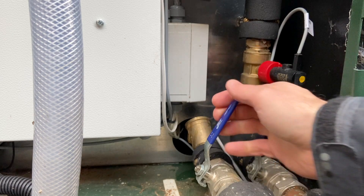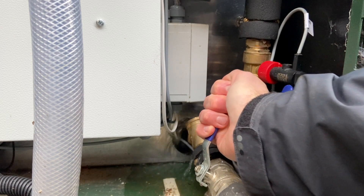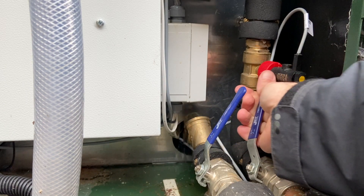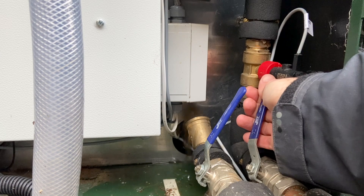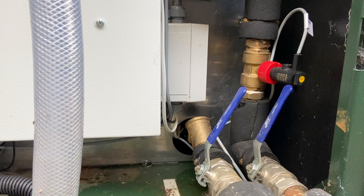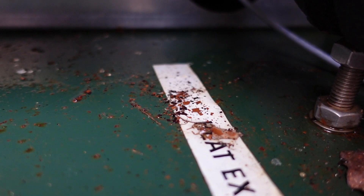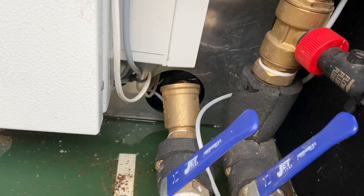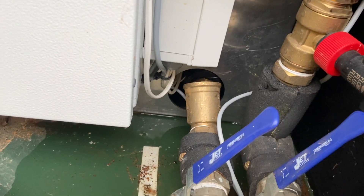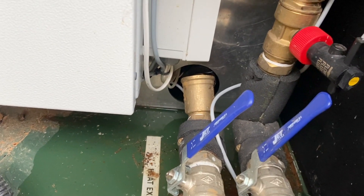What you've got to do is take these taps and just clear it out. One very important point to add here is that only flush out small amounts of water — enough just to push out any debris — and the reason for that is that every time you're flushing out the water you're also flushing out glycol or antifreeze that's in your system. Obviously you don't want to drop those levels too much because that can lead to its own problems, so when you're flushing, small quantities and don't overdo it.